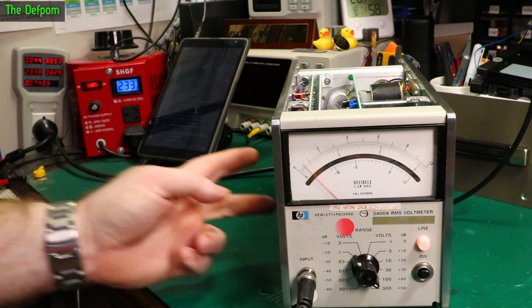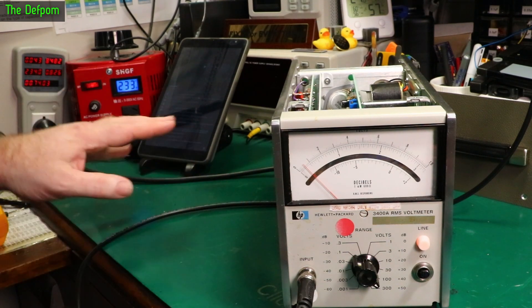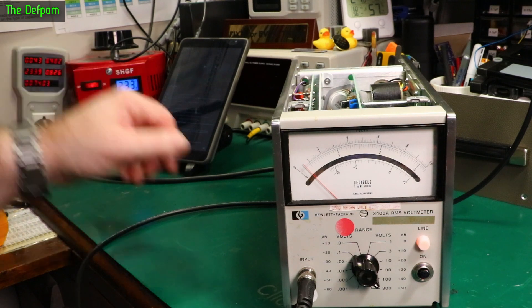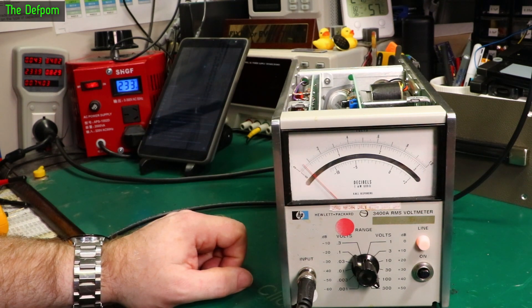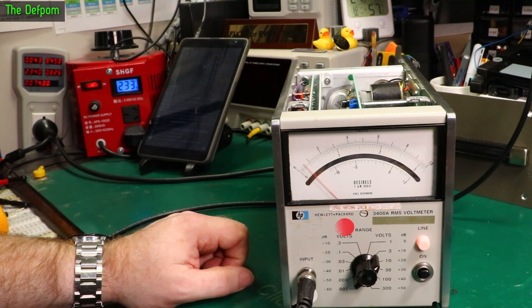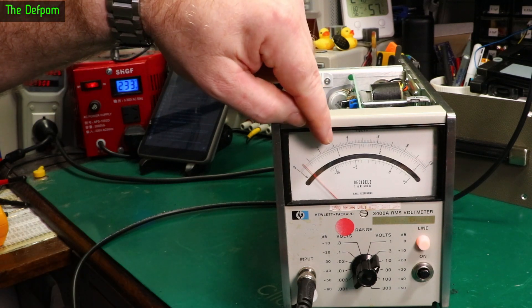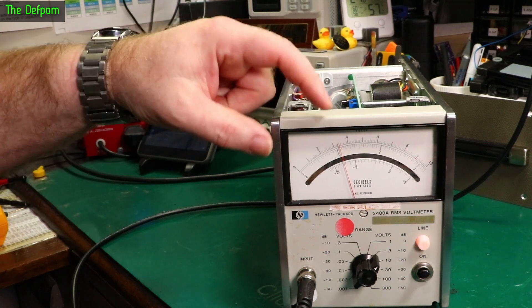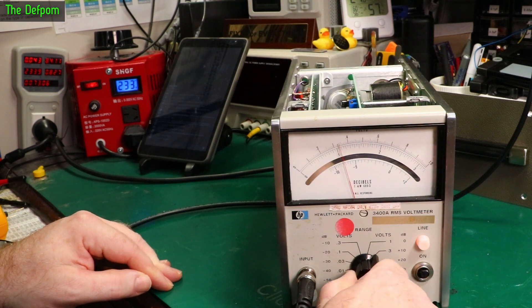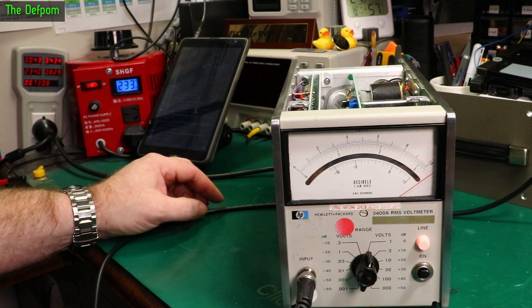I'm going to watch and see what it actually does. I think this may still have a Nuvister in it - which is like a little valve which has to warm up - so it's stabilizing at about 8.5 watts. I'm guessing there's a bit of capacitor reformation going on. That's all stabilized. So we'll drop this down to the 3 volt RMS setting and inject what should be 1 volt RMS, which means you should get a reading of about here - and we do. It's settled down, reading very slightly high. Let's do 1 volt which should be full scale - and it's just over very slightly.